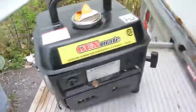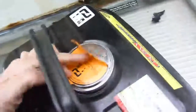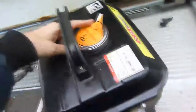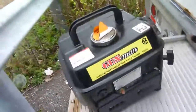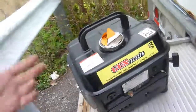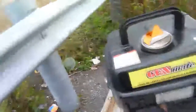That's my generator — it's got no gas in it whatsoever right now. I have to go purchase some. If I buy 10 liters, I can put in 200 milliliters of oil — that's the 50 to 1 mix. I'm just hoping that after I mix it this thing really starts, otherwise I'm stuck with mixed oil.